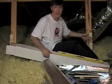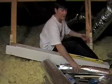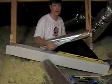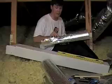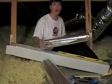This is all about radiant barriers. What we're going to talk about is what you need to do this. Basically, the number one thing you need is foil. Foil comes in several grades. You can get essentially polyethylene or polypropylene with aluminum bonded to either side. Most places that sell this are going to have more than one grade.